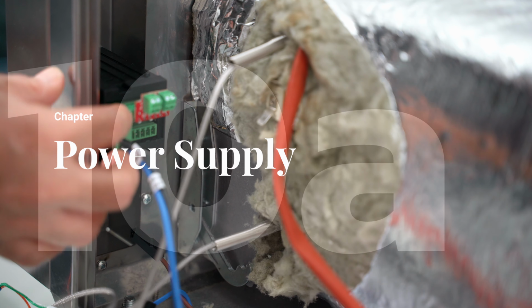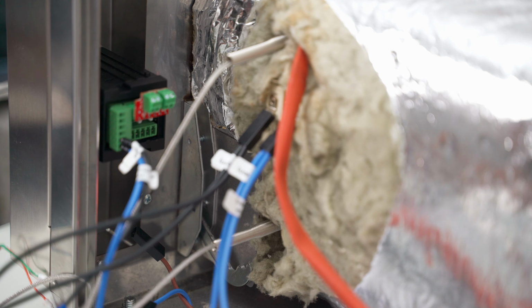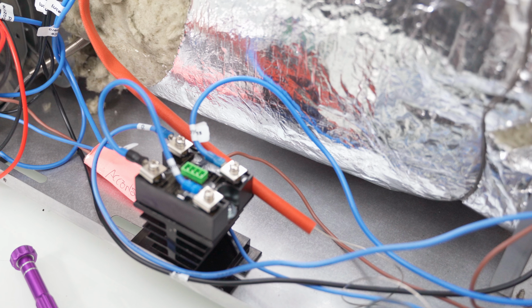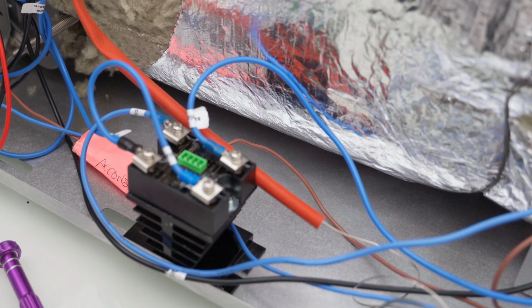On each of the cables there is an oven light label, so we are going to insert the two fastons behind the lamp, and also in this case we are not interested in the polarity. We position the SSR on the base of the oven, having A1 and B1 on the left of the oven, which is basically the part facing me in the video, and we use the fork terminal cables for the top